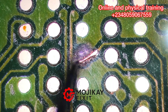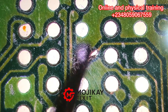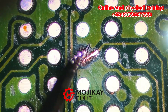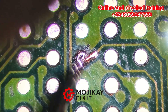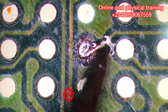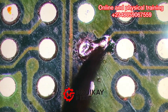What we are going to be doing now is adding solder onto this new part that we've just repaired — we're going to create solder on it. Why do we do that? It's a form of foundational part, trying to make a connectivity path for the BGA that is going to sit on this particular part. It's not going to be something new to the part.